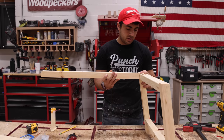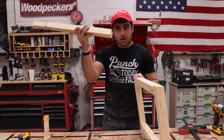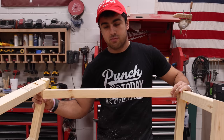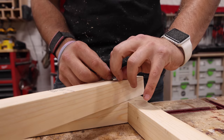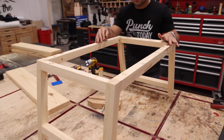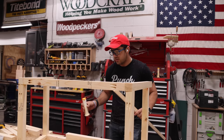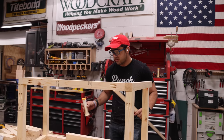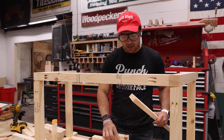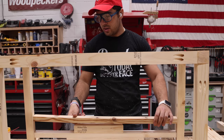Next up are the skirts — front skirt, side skirt, it's all perspective. I'm gonna take these pieces and attach them like this. After pocket-holing them — and if you don't want to pocket hole you could brad nail or face screw — the method I chose involves saving your cutoffs from the two-by-two material as spacer blocks. Go in like this, bada bing bada boom — go to the next one, work your way up, and the base will be complete.